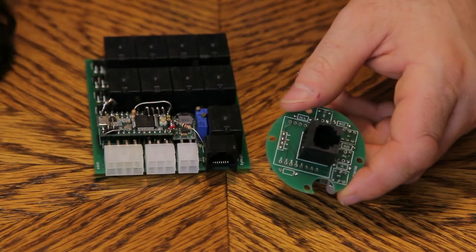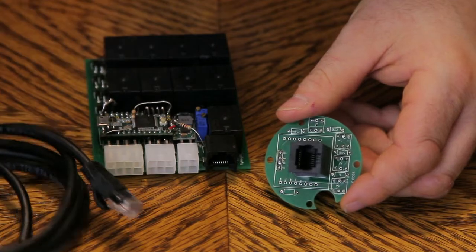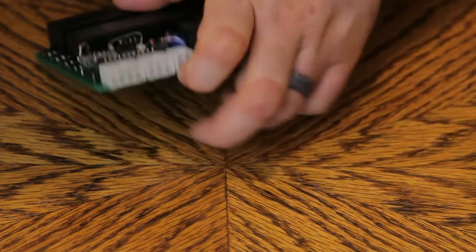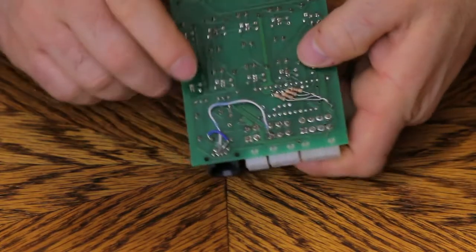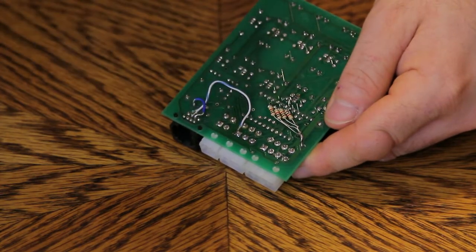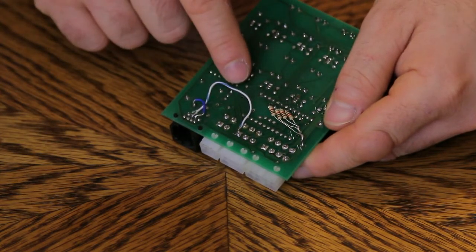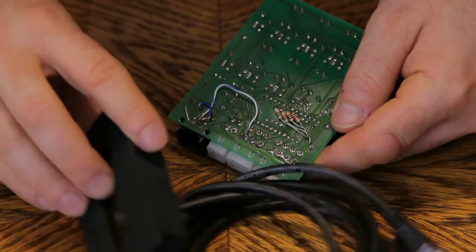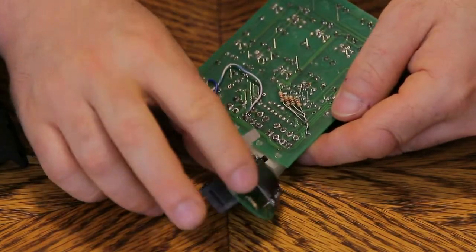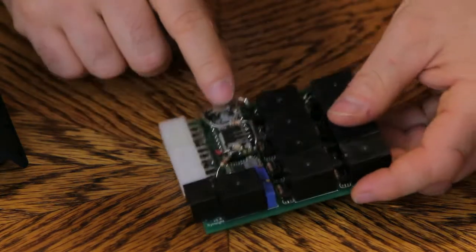Let me show you this. It would plug into either this unit or this unit, and that's dictated — it's already pre-assigned by me. This is why it takes a while, because you find out that you either did something wrong, you need to add something, or it wasn't efficient. These are just jumpers, so only this one would work right now. But in the future this will have a jumper on it, so this would work too. It would be the same circuit board — the difference would be the jumpers and the actual code that's in this Teensy.